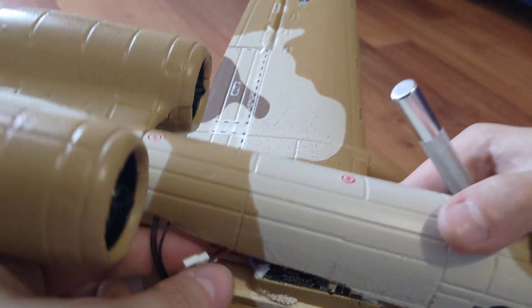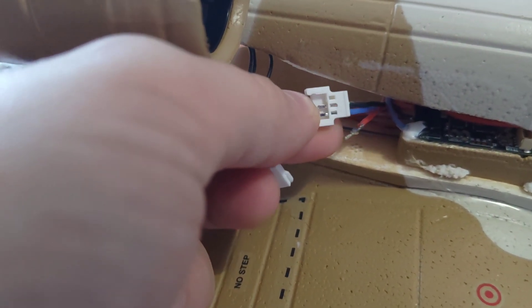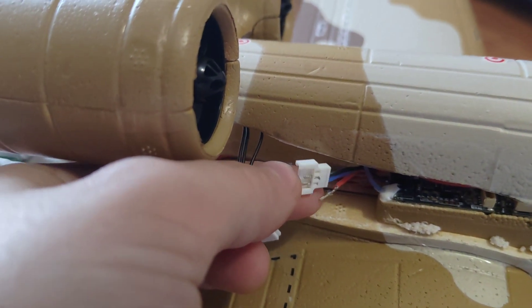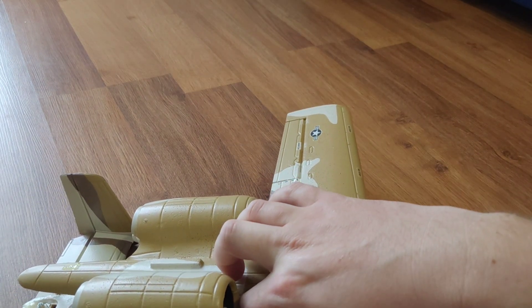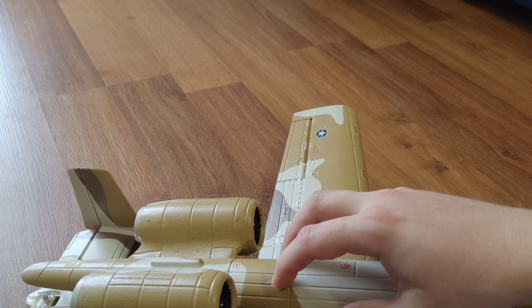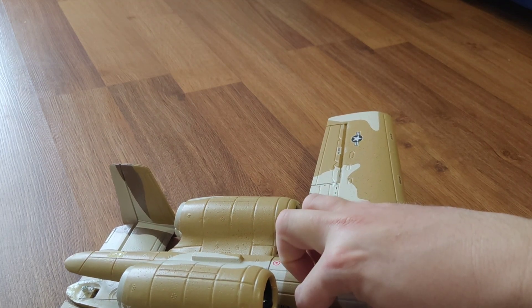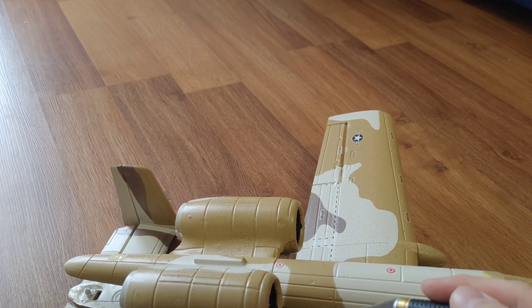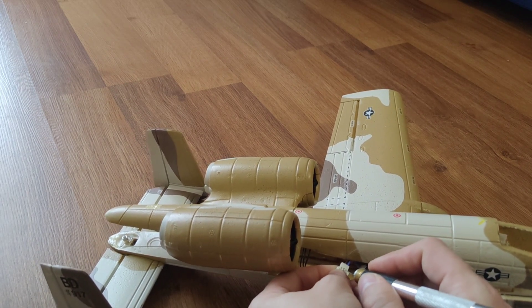And apparently it wasn't. Then all you need to do — see the connector has these holes here — these pins go in. Yeah, looks like the middle one is also coming out, I'll take that out as well. If you do take these out, you have to remember the order. On this one it's blue, black, and red — black's in the middle. If you mix them up, the motor should still spin but it'll probably be spinning in a different direction.